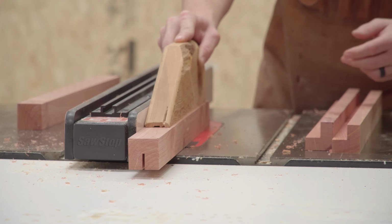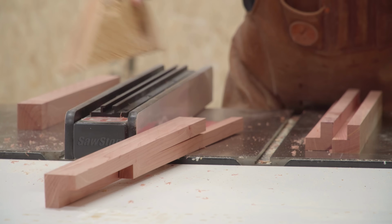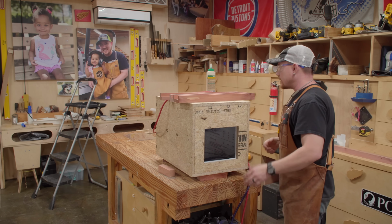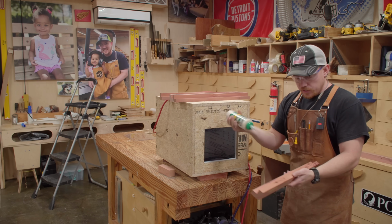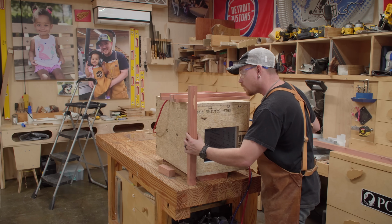Anyway, 1 5/8 inch stock. I'm just going to cut it to final length and then use the table saw to make two cuts to form a rabbet. I want the legs to stick down by 1.5 inches, so I'll use one of these offcuts, which is 1 5/8, close enough, to elevate it off of the work surface. Then I can use some glue and brad nails like the old days. Glue and brad nails for everything.